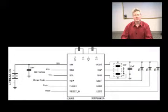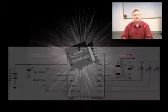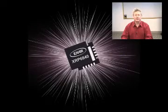In this architecture, the supercapacitor is used to store and provide the instantaneous power to the LED flash while being charged at a low constant current from the equipment battery. The XRP6840 provides all the features and flexibility needed to implement an easy supercapacitor-based flash LED solution.